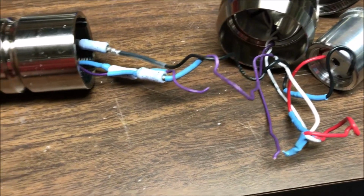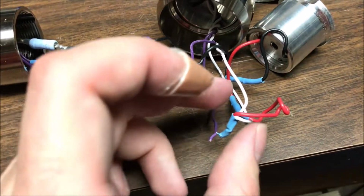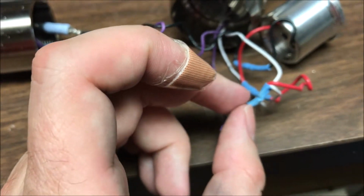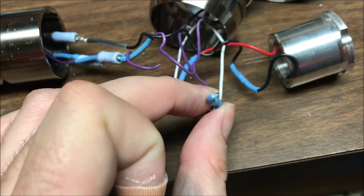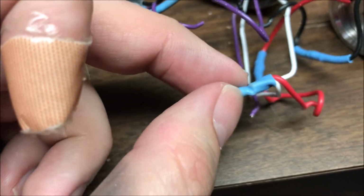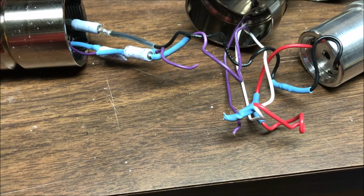So the red wire, the power wire here, well, it's power circuit wire anyway, it actually had connected up to this. So it broke right where the heat shrink is, and it's got multiple wires going in, which is fine. Multiple wires all soldered together, it's normal. The only extra reason I see why it maybe failed there is some extra burn marking on this heat shrink, so I think maybe it was overheated and weakened a little bit.